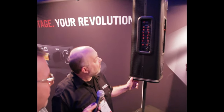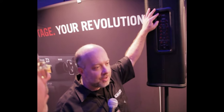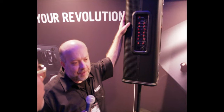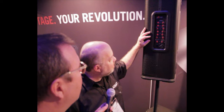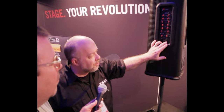It's not unique that we have a mixer, but we have a two-channel mixer with sweepable mids. What makes it more Line 6-ish is that we incorporate modeling and intelligence into the DSP of the speaker so it knows what mode it's in and adapts accordingly. For instance, if you plug in an acoustic guitar running off a piezo bridge pickup — typically not the most acoustic-sounding thing — we have a built-in model that compensates for a typical piezo pickup and gives it more acoustic feel, adjustable to taste. We also have reverb, a vocal doubler, sweepable mids, individual gain, and an input for an iPod or iPhone — two completely separate channels.